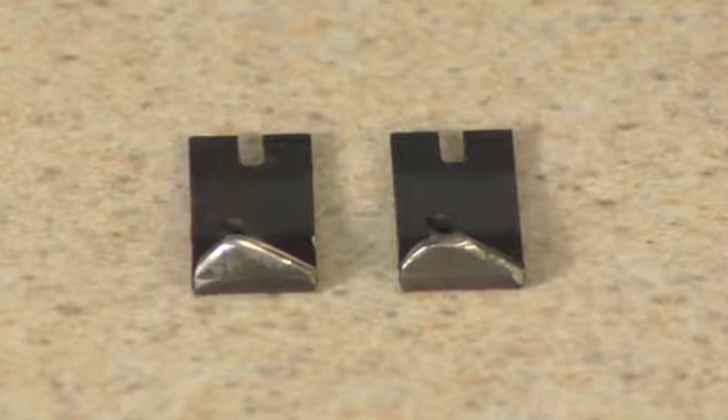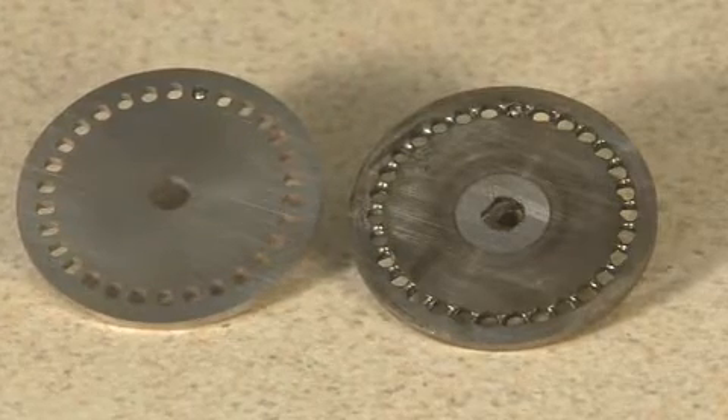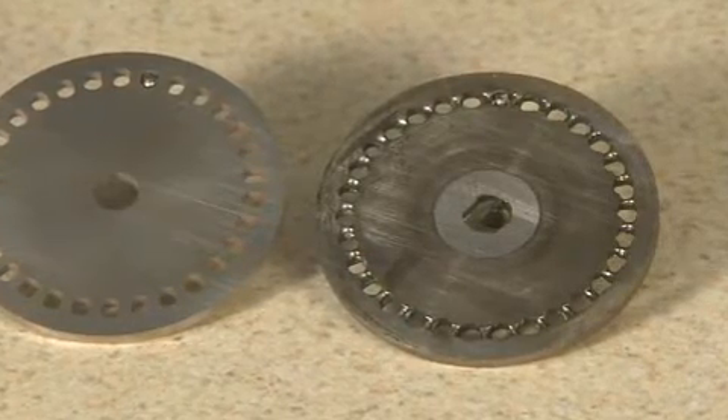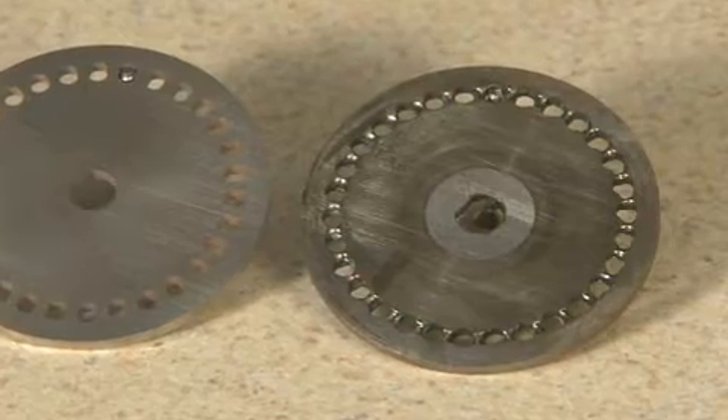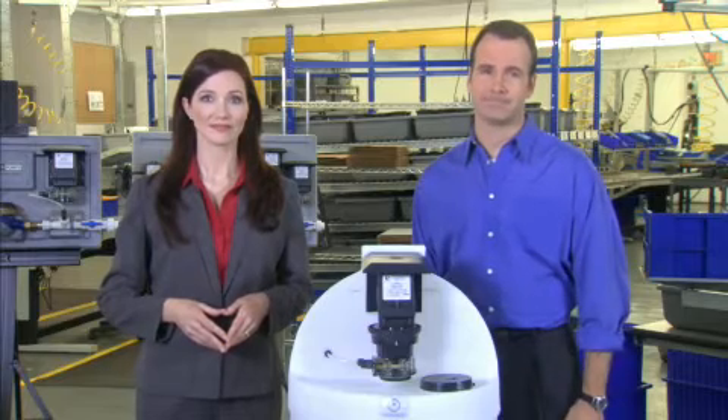The pin will make a ratcheting sound from dragging across the plate. The feed rate control will index inconsistently at different settings. A worn cam and/or lifter can cause the index pin to drag across the index plate and elongate its holes. The pin will skip across the holes and cause index malfunction. The vertical mount with the pump head pointing in the downward position is important for the feed rate control too. Corrosive chemical intrusion can corrode the index pin and/or the lifter causing them to seize. The feed rate will malfunction and the parts will need to be replaced. With the modular sub-assemblies, a new feed rate can be snapped on quickly, but the parts are just as easy to replace.